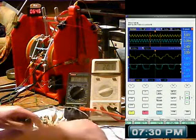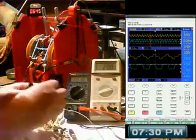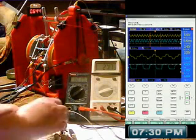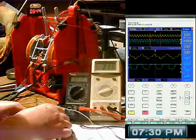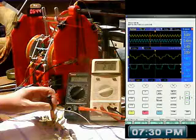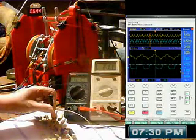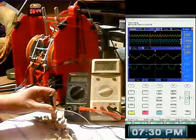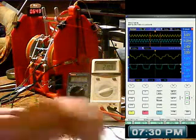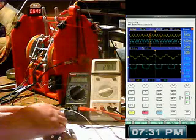I'm going to stick this capacitor back between there and there. Just move that pink wire, and I'm going to stick this .22 across there. No, that doesn't do a thing. The 22N is not big enough. Let's put the 220 in again, down to be between there. There.